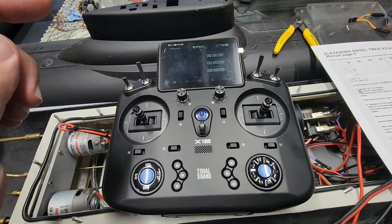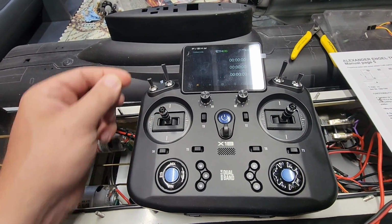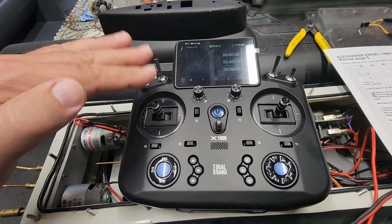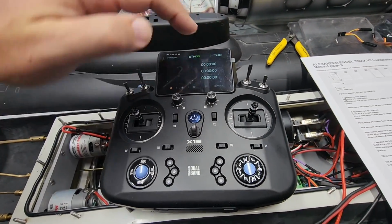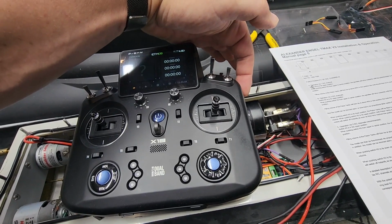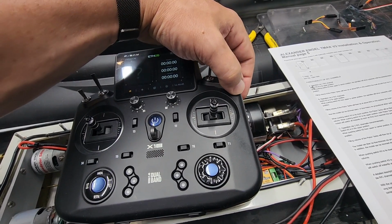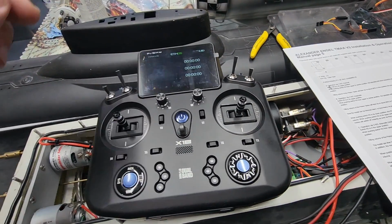And then you've got 2 sliders on the side. And the reason I put them on the side is because there's a definite up and down to these. So the left slider trims the boat forward and back, so you can make it do this kind of thing. And then this one is fine-tuned adjustments of neutral buoyancy. So you could, for example, go to the center position, and then if the boat is sinking slightly, you could use this to adjust that neutral buoyancy.